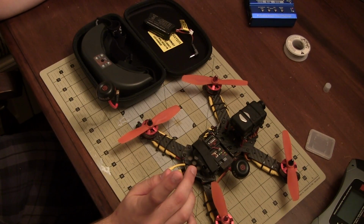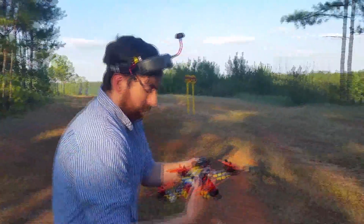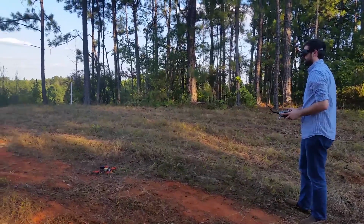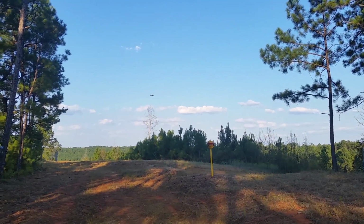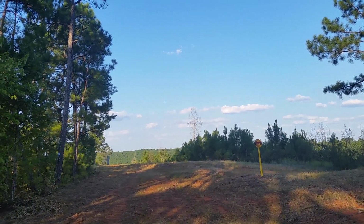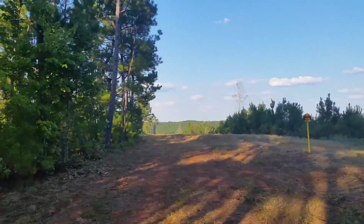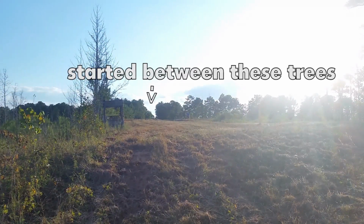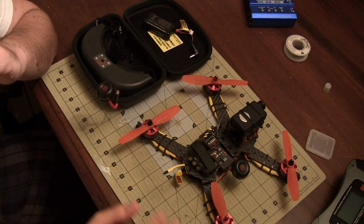Oh, one more thing. I did a range test with this system the other day. Unfortunately, the Mobius camera is not working, but we still were able to test it. Line of sight, no obstructions in the way at all. We were able to test it, and there was snow, little static on the screen, from about 150 yards until it blacked out completely at about 300 yards. This will change dramatically with your surroundings. If there's stuff for the signal to echo off of, it'll change that. If there's trees in the way, if there's any line of sight breakage at all, it craps out pretty quickly.